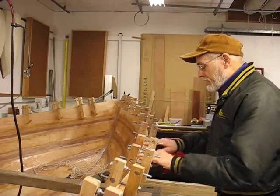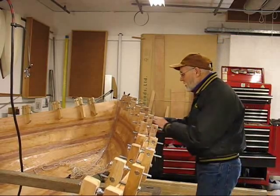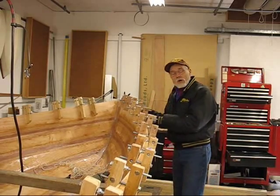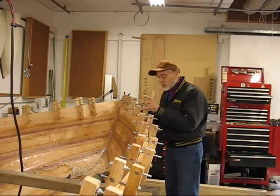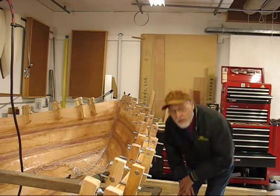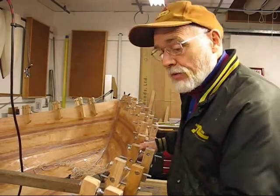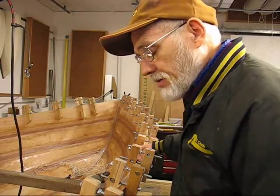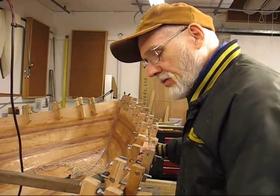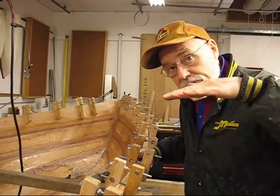Go along and find spots — I got a little high here, but I like the curve that I've got. If you had a spot where the rail was a little higher than it should be, just take a hammer and whack it down, sight down it, and make certain that everything is in line. Now that I'm happy with my rail from start to finish and nothing is above what it should be, I can stand a little bit of change.